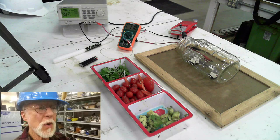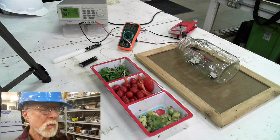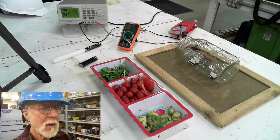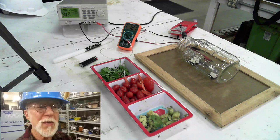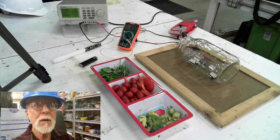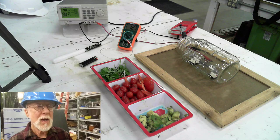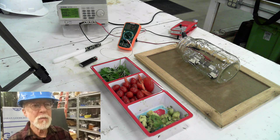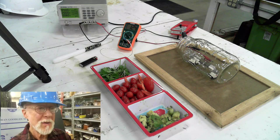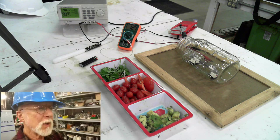Then we looked at the little dabs of castable alumina cement that I put on there. And you could also see a color change in those that Bob had talked about. And it's quite striking. It reinforces what we appear to see in the data, which is that the emissivity changes as the material heats up above, say, 900 C. It seems to go through a phase change, and it initially goes from an almost white, a bone white, to a grayish color at maybe 400 or 500 C. And then as it heats above 900, it turns absolutely bone white. And there apparently is a drop in emissivity as it reaches that temperature. We have good data that supports that, and it bears further looking. But there's something going on with that material at high temperatures.